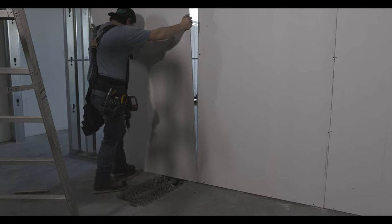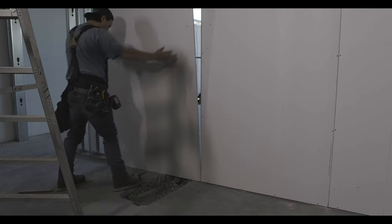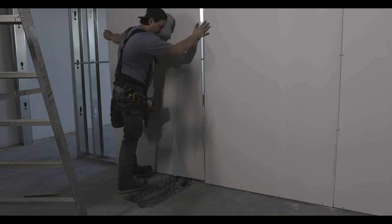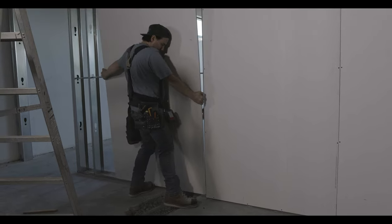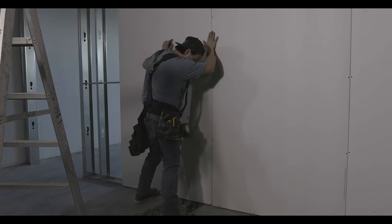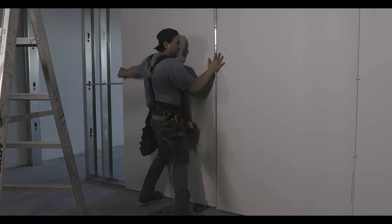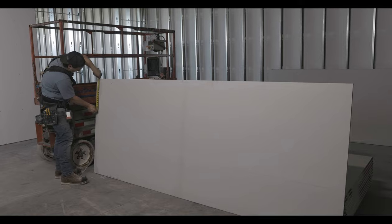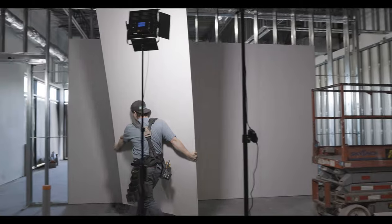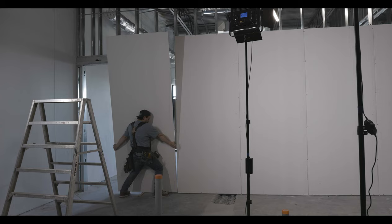Just think about the technique: I use my shoulders a lot to lift my sheets. Keep your back straight, your knees, heels, and shoulders as square as possible all the time. Those drill hooks are great — the lugs are awesome drill hooks to help you go hands-free. The drill's right there; you don't have to set it down. Here we are drawing centers again — it goes forward or backward, doesn't matter — just hold it strong, tape square.